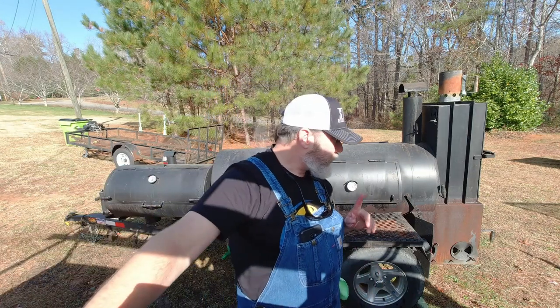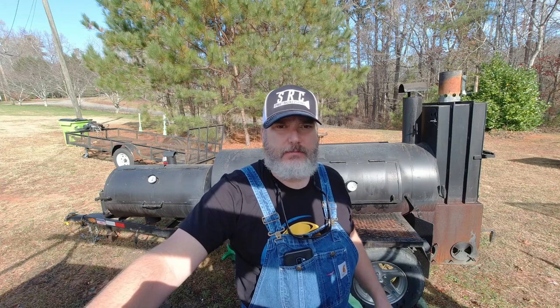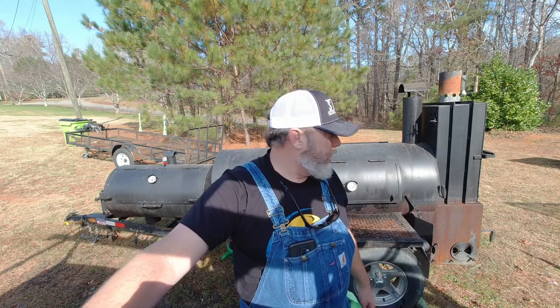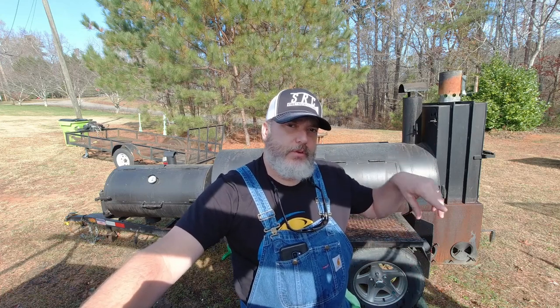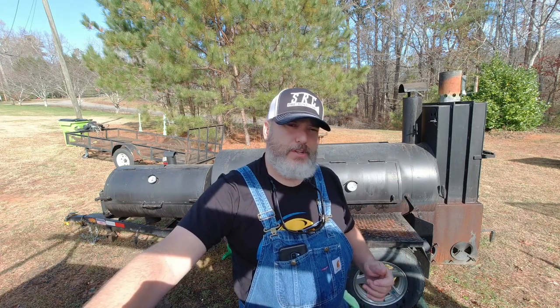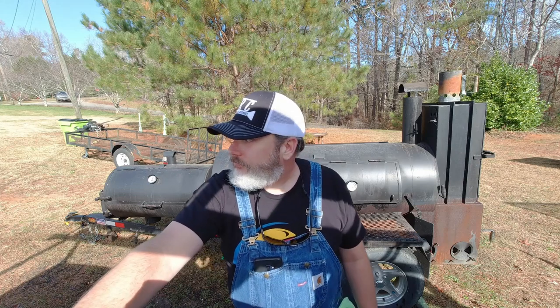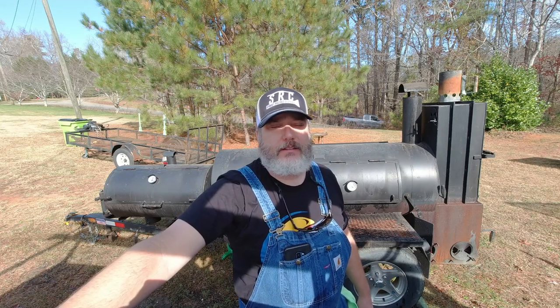All right, that's going to be it for this video. Appreciate you watching. If you have any problems with your drain, just try to heat it up — it gets that grease loosened up a little bit. Stick something through there. Get a fire going; get that plate heated up as well. You can take a little torch and heat the bottom up — just don't melt your valve down there. I'd stay away from the valve and heat the top of the tube, not the very bottom. I might even get some engine block cleaner brushes, stuff that through there real good and hot. Anyway, if you like this kind of stuff, hit the subscribe button, hit the like button, share it if you like. Come back and see us next time. Thanks.